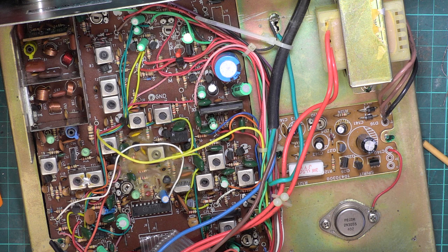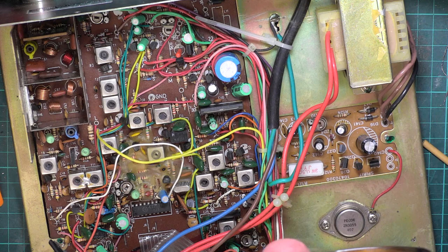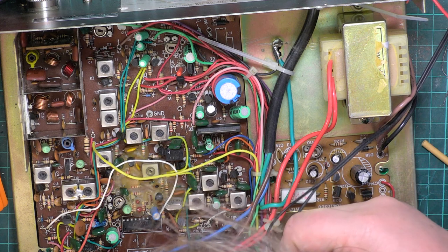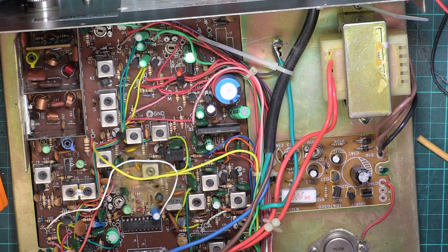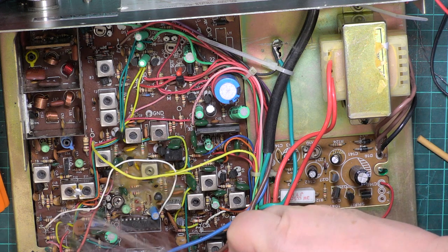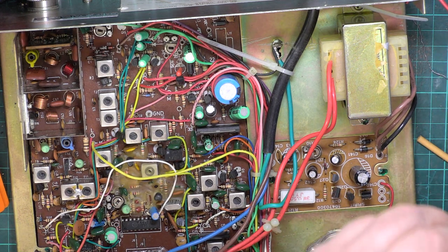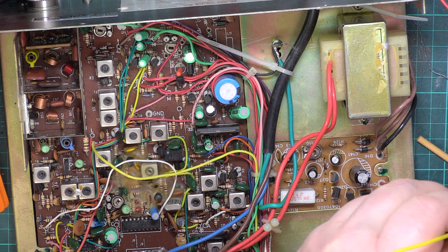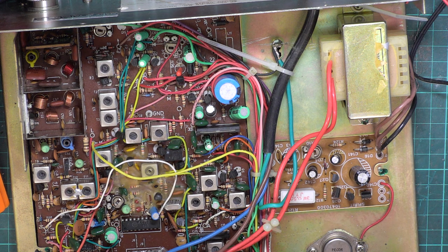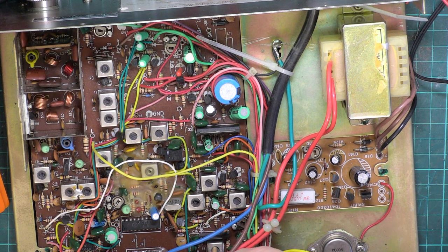What we're going to do is just put 100 microvolts on the radio, and then somehow we're going to have to connect this to the test equipment, no doubt with a crocodile clip lead. As I said earlier, we haven't got an extension speaker socket on this type of radio. So put that on the audio hot. Should only need it on the inner because the radio is earthed through the aerial socket. And then I reckon it's T8, so we'll adjust T8.